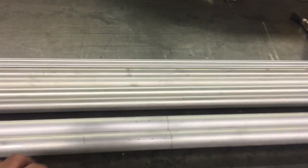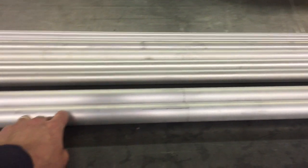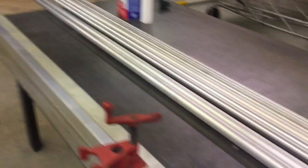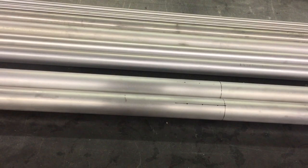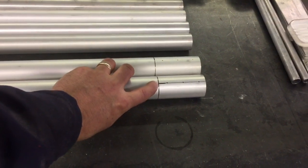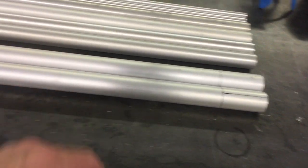What I've got so far is I've got it marked out. It'll have a second tube that slides inside this one — it'll be eight foot long just to strengthen it a little bit. This is where my eight foot ends, and it'll get riveted in place just to keep it from wanting to slide around inside there. And then I've got it marked on the ends where the six foot will slide in, and it gets riveted on just to hold it in place until everything's welded together.